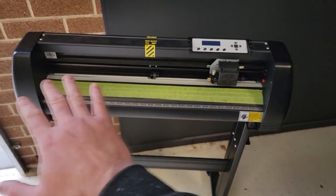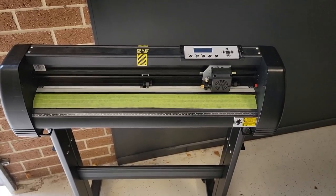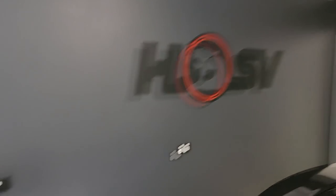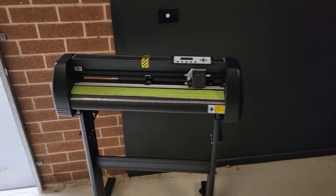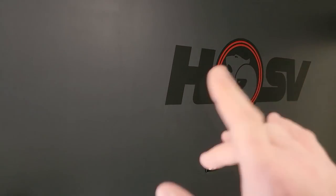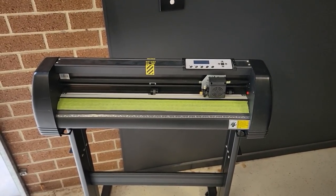It's got a 600mm wide X-axis, so you can put 600mm wide rolls of vinyl in it, and it can be as long as your roll. If you want a decal 600mm wide and nine meters long, you chuck a nine-meter roll of vinyl on it. I did that wall decal on this machine and it came out pretty good. I'm going to use this to cut all the decals for the externals — some as masks to paint panel lines, and actual markings cut in black vinyl to stick on as stickers.